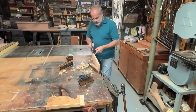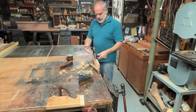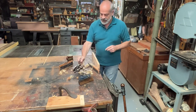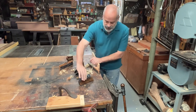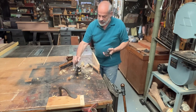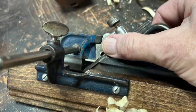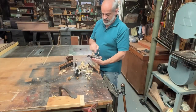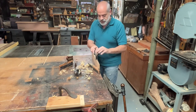The 50 is interesting because it's more typical of the way Stanley designed their plow planes, with this handle grip up here, and it works pretty well. You can see I did two grooves right next to each other, but this is a smaller plane by far. This is interesting because Record made this one with only one shaft coming out for the fence. The 043 has two shafts coming out, and that may make a small difference.